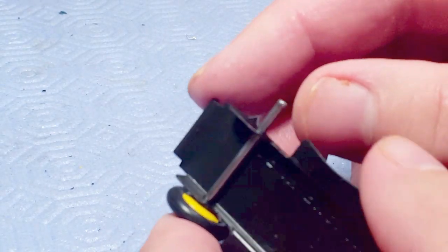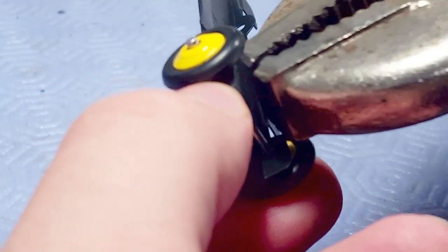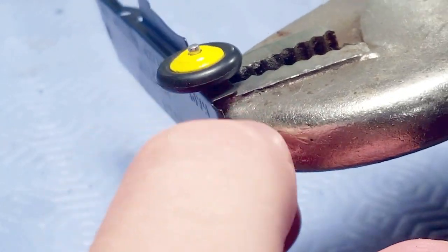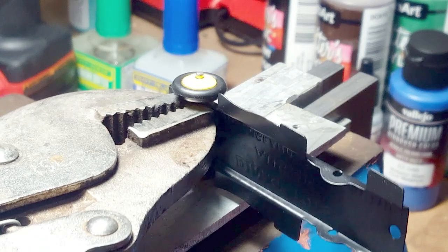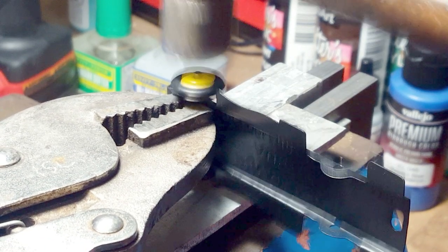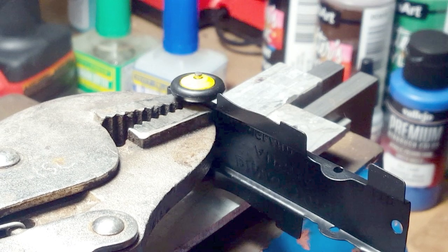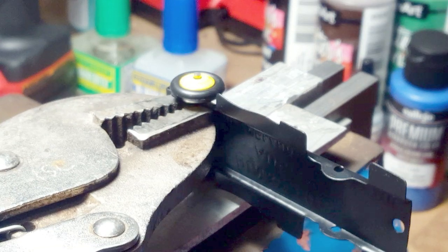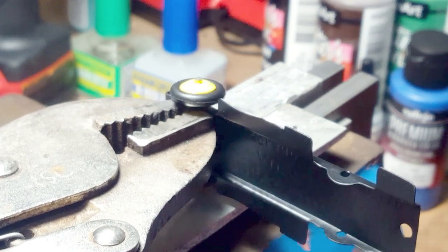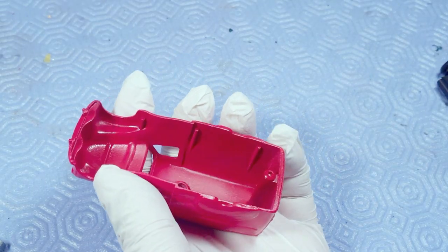With the polished axle, only one of the axles needs to be mushroomed — the other is inside the body so it doesn't need one. My technique is to use a small hammer and a whole bunch of taps. You have to do a lot of taps otherwise you'll bend the axle. I clamp it in my specially modified vice grips for that job.